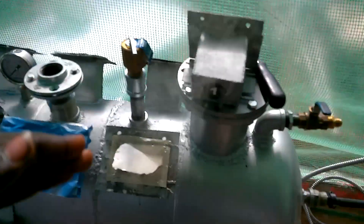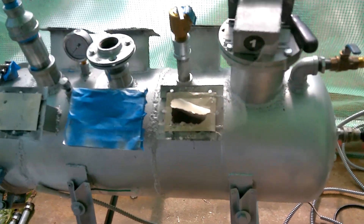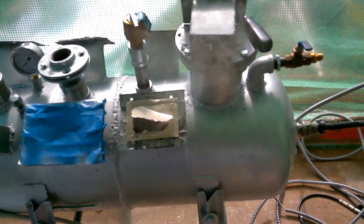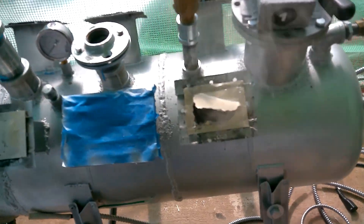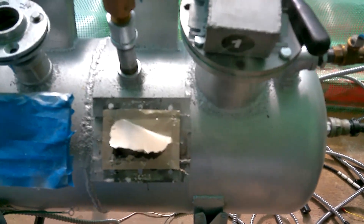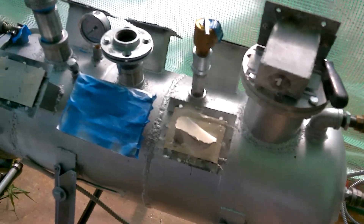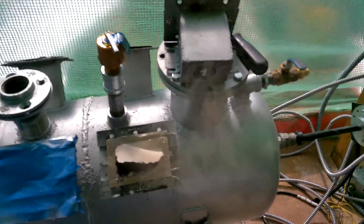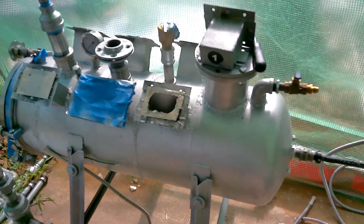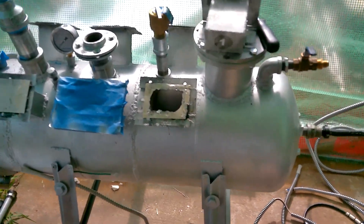After taking the waveguide off, we can see the mica is popped. I don't think it was an explosion or a burst of pressure at all — I think all of this just built up to a pressure that the mica couldn't handle, and then it popped and released that vapor, which released the sound and made it sound more violent. It wasn't violent at all, nothing shot anywhere, these just popped. So our issue isn't too much pressure — our issue is that some of these materials aren't rated for pressure. I'm going to replace the mica with the last option I have. I feel like Thomas Edison experimenting with different filaments for the light bulb, trying different materials until I find the one that works.